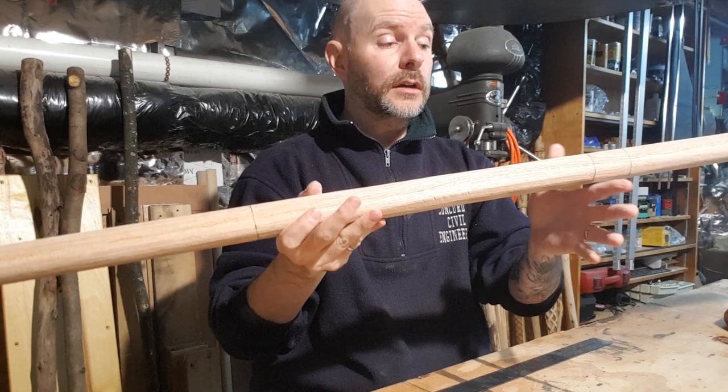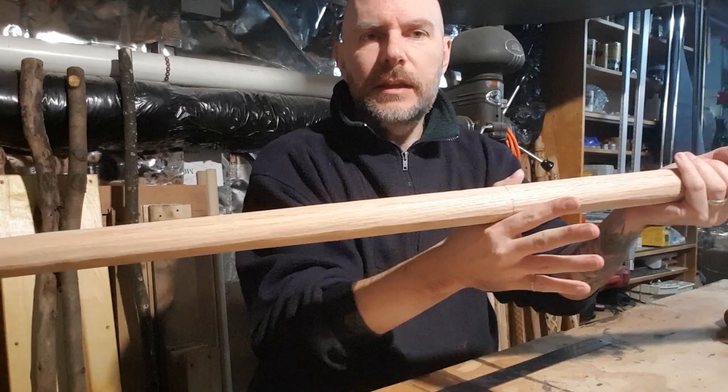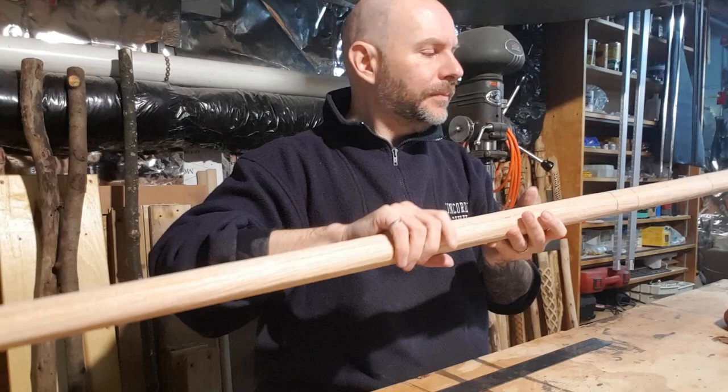So laid out the lines for it. We got 8 inches of handle, a little bit of a space in between. The basket weave is going to go, for this one, 16 inches. And then we're going to taper it down. So we already marked out center of it. We'll use that later when we taper this all down to the small foot, probably, I don't know, 7/8 diameter it'll taper all down to.